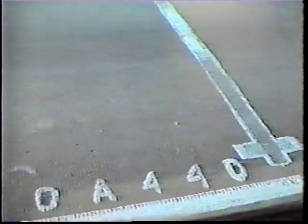You can see here some of the spalling and deterioration that's taken place at one of the joints. You can see that there is some vertical motion taking place at one of the joints that formed in the mid-panel. We'll go through today the process of inserting dowel bars to eliminate the vertical motion in these joints, allow horizontal motion, and hopefully rehabilitate the surface so that it becomes smoother.